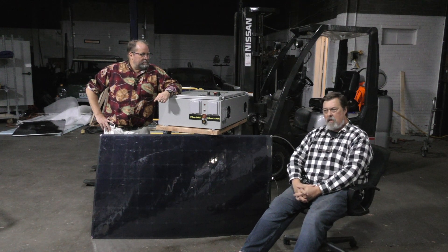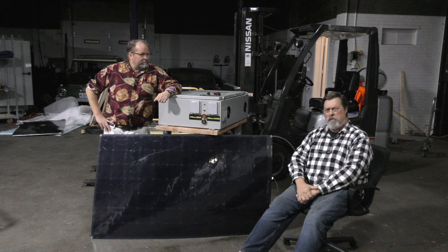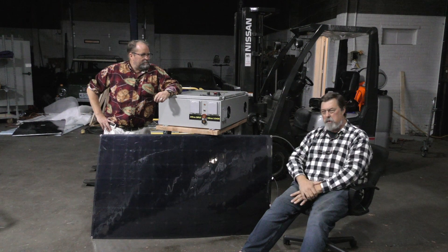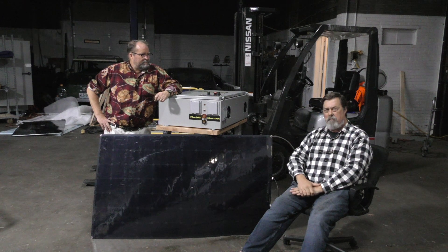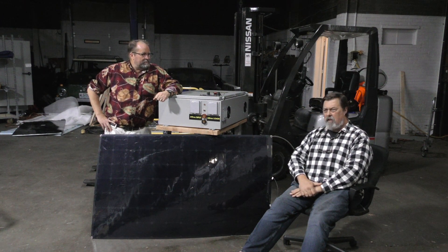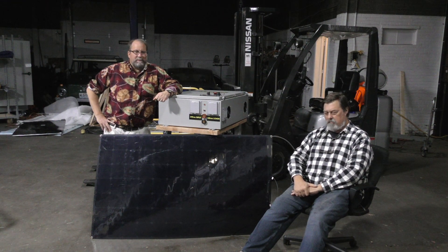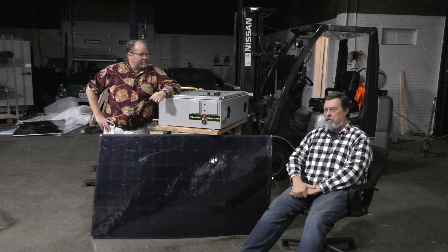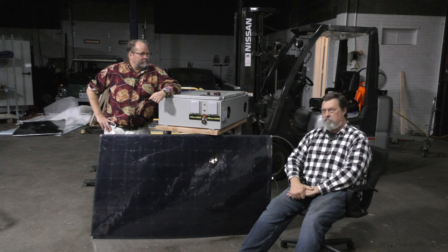So I found some of Jack's videos, and one that really interested me as an electrical engineer was where he talked about running an experiment in his building with his solar panels. He hooked up a PowerSafe and started adding the numbers up. He had solar edge inverters — I think five of them — and he turned one on, waited five minutes, checked measurements, then turned another on. At some point the numbers didn't add up, and it was like: where's that current going, why don't I smell smoke? He basically discovered that they were back-charging the inverters. He thought it might be the transistors running in reverse — which I guarantee they will not do — or possibly acting as a rectifier, which in a sense is kind of what it is doing.